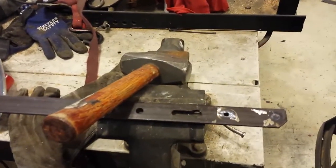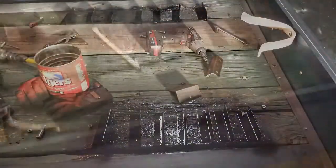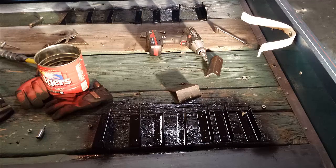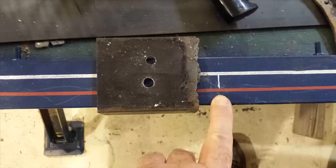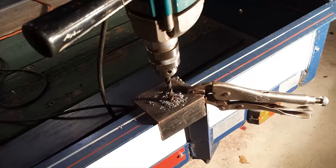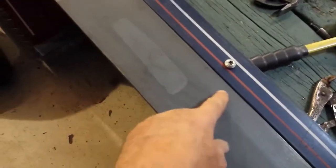As you can see, I've got the braces cut and painted. What I've done here to get all the holes in the exact same spot is I made a little bracket so I could drill right through each hole after clamping it down to the area I wanted. Put the little mark right there so I would know exactly the perfect spot, then used my drill and drilled the hole. This is what it's going to look like once we get it done — we've got it laid together right now. This will all be bolted to the braces and probably welded along spots as well.